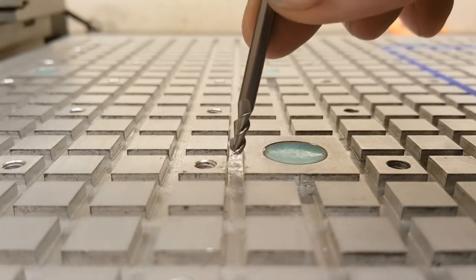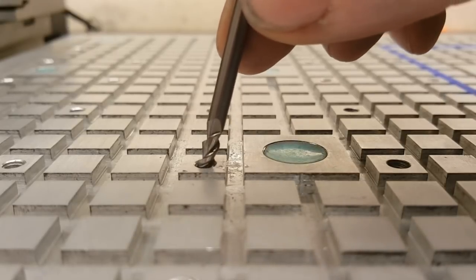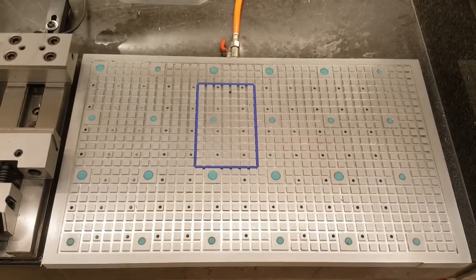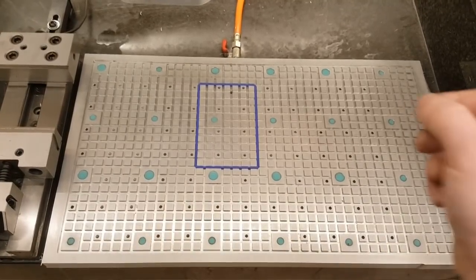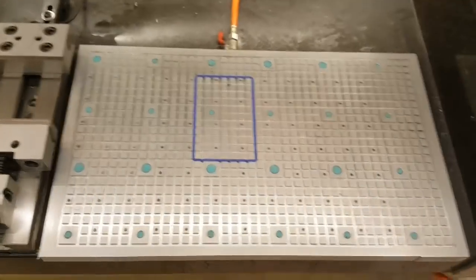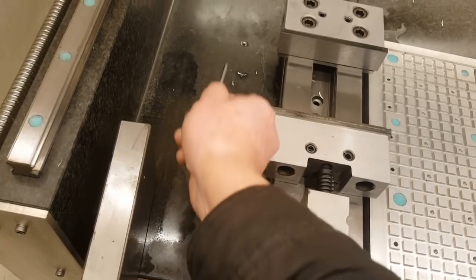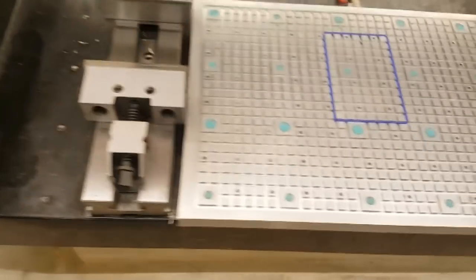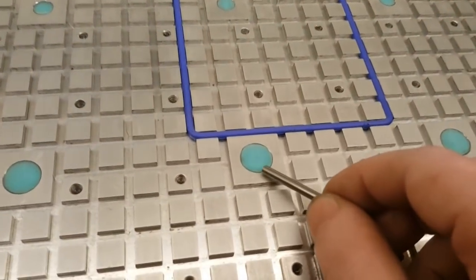The standoffs are 10 millimeters by 10 millimeters, and every fourth has a threaded hole. To prevent any vibrations and to distribute clamping force very uniformly so it doesn't deform the vacuum plate, I bolted it in 24 places — under those green plugs — to the granite plate, to those inserts which I have scattered all over the table every 10 centimeters. And to prevent air from getting in, all of those holes are filled with mold-making silicone.